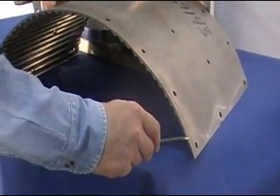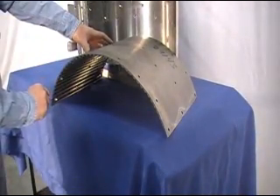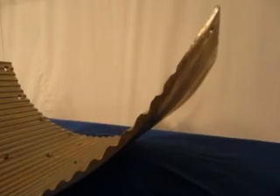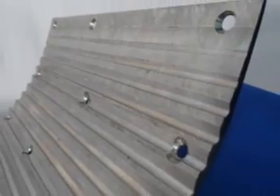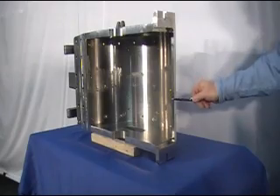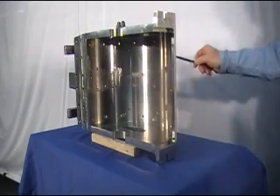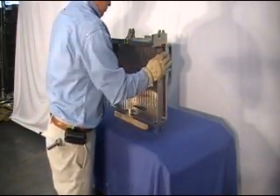The liner also has a secondary radius on the infeed entry side so that it coincides with the machined contour of the cover. It is important that the liner is installed in the correct orientation within the cover. The leading edge of the liner is machine tapered to 3/32nd of an inch thickness. The tapered side of the liner should be installed toward the infeed side of the cover. The liner is now manually positioned inside the cover.